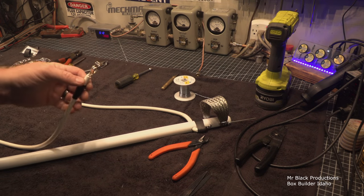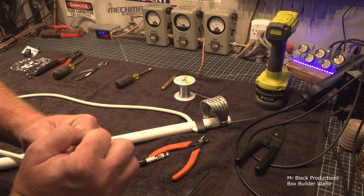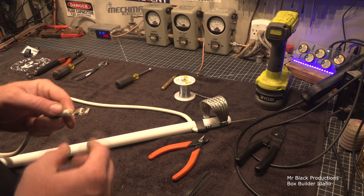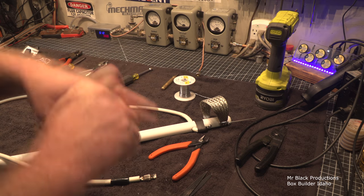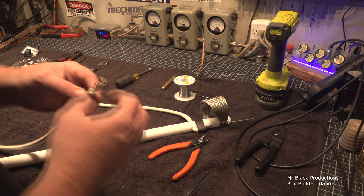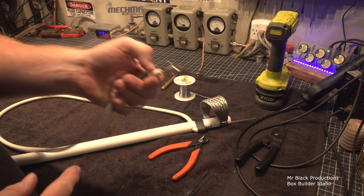Okay, so you remember me saying the twisting and the torque load of the wire, high voltage wire doesn't, okay. So the part that you would normally take and bend over the wire and then crimp down on the wire to give yourself an electrical connection, I mean pressure bond, I mean bullshit connection. I took and I trimmed that portion of this back. You have a metal bar that comes off the back, and then you have the ear that supposedly folds over the wire, and then you crimp onto the wire that's supposed to create the good connection, which it doesn't. That ear, I trimmed it off at an angle, so it's more like a knife blade. And I'm going to capitalize on the fact that this is soft. I slid that in on the clamp until it's about that far up into the portion of the wire here.